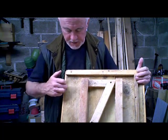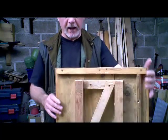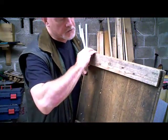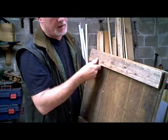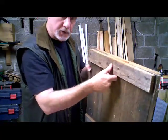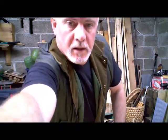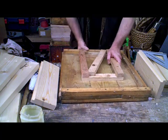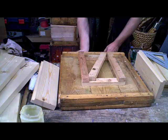This timber is also well seasoned — it is pretty old and has been around in my workshop for a long time. Another little trick worth noting: if you screw or bolt a section on the back as a lip to go over the edge of your bench, when you drive screws into your box ends, you can rest that lip over the edge of your bench and push against it, and the thing won't move.